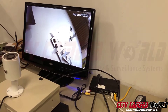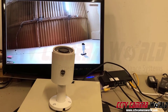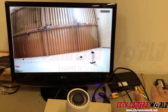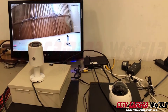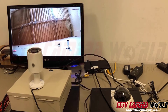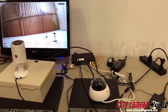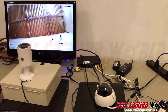You can see that delay on the NVR. Now switching to the DVR — you can see the response is instant. So if you have an application that requires no latency or lag from when motion is happening in real life, coax cameras are the way to go — even with a thousand feet of wire. With IP cameras there is latency because the digital signal gets transcoded in the NVR before being displayed, which introduces delays.